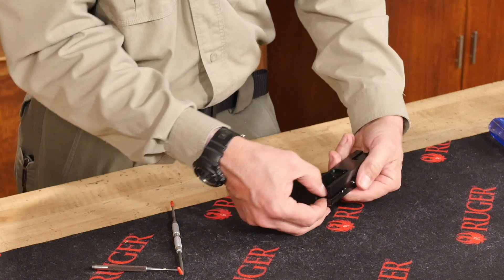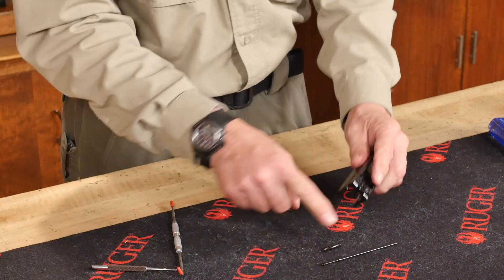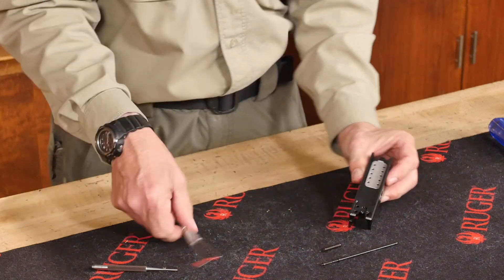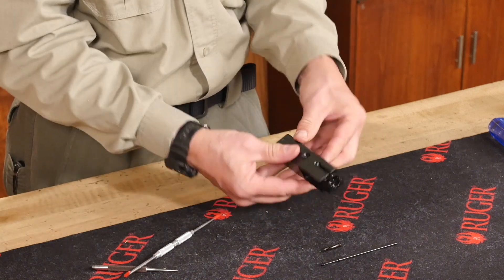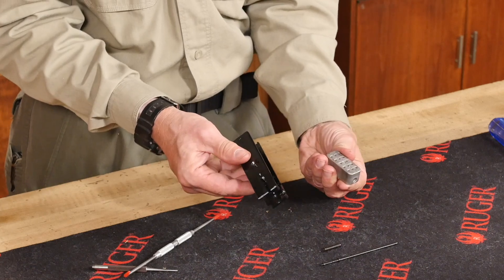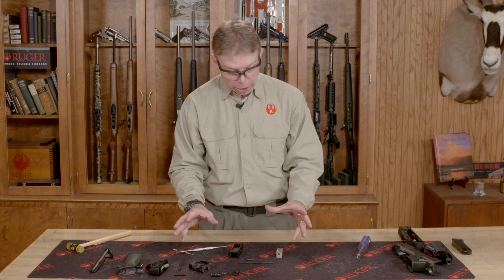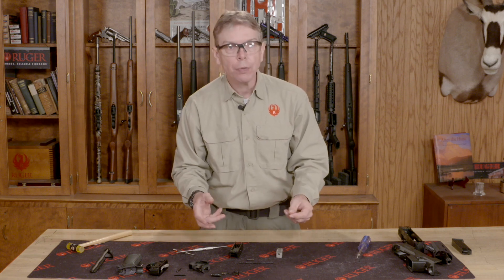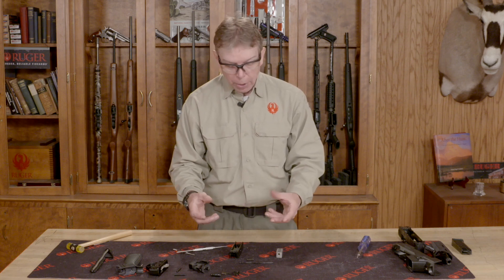That gives me access to the firing pin spring. The firing pin will come out, and the firing pin goes through the dead-blow weight here inside the receiver. If I turn this upside down, that just falls out under its own weight. And that is everything — that is complete disassembly on the PC Charger. There are also videos on tech tips on cleaning, and we assume you're cleaning and inspecting the gun at this point. You can watch our tech tip videos on cleaning the PC Carbine, which applies to your Charger. Thanks for watching this Ruger Tech Tip.